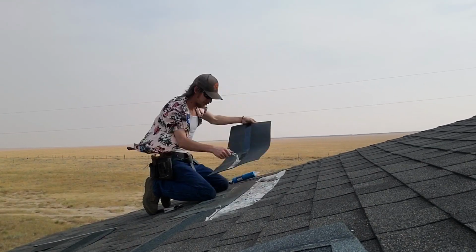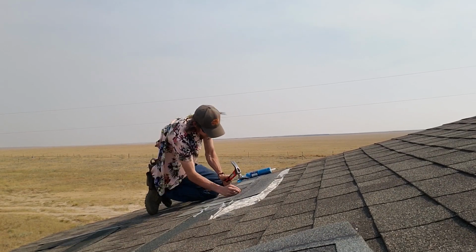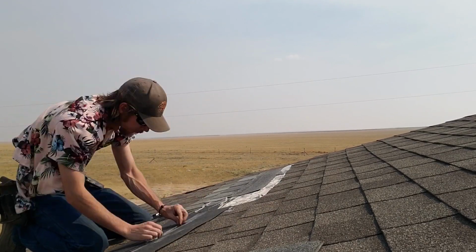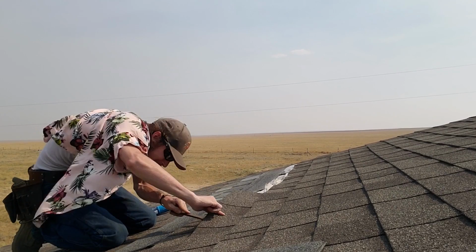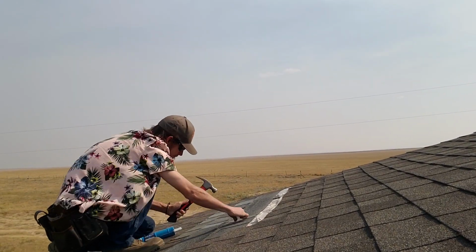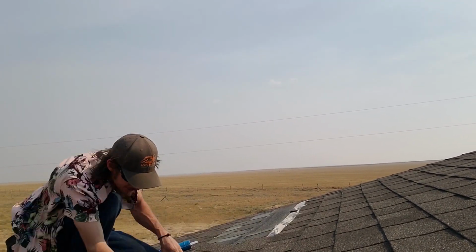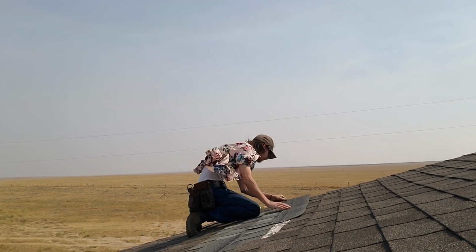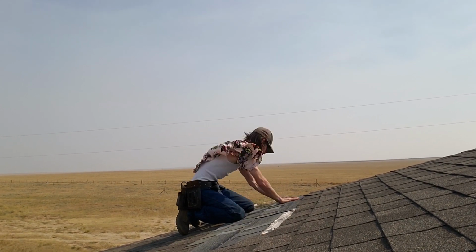Be good after that. So I'm just going to continue on laying the shingles again, starting at the bottom. Lay a bead of silicone, lay the shingle on top, tack it down with some nails. 1 row straight across the middle, and then when I do the next row above the middle row on it, we'll go through the top of that shingle as well, making that 2 rows, like I said. Now it's kind of funny, when we started off working on this, before I climbed up the roof, no wind at all. Once I got up there, here we are fighting 40-mile-an-hour wind. But all in all, not a bad day.